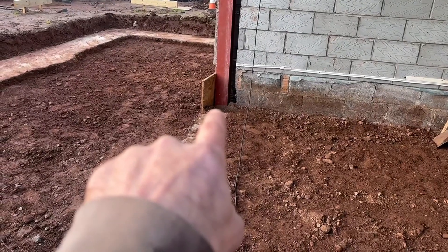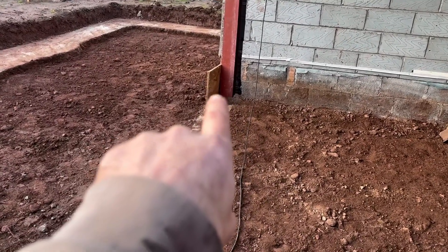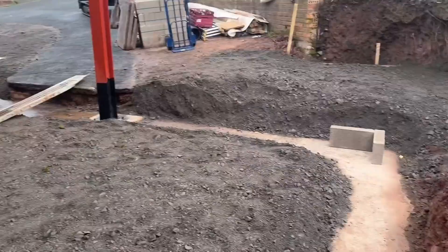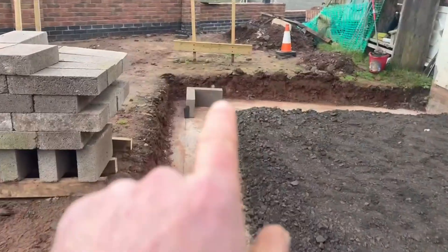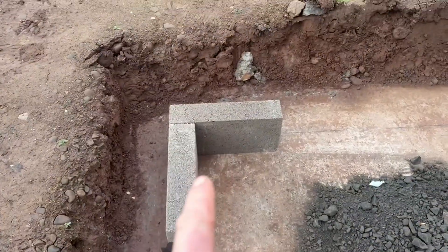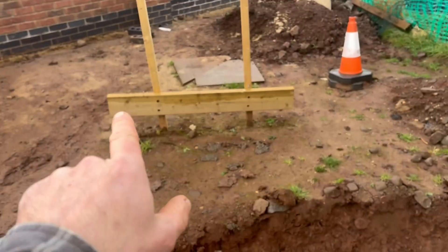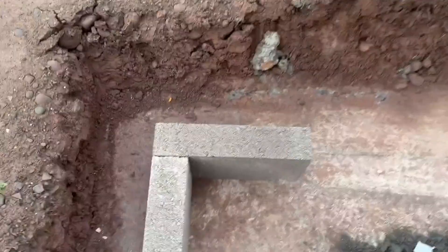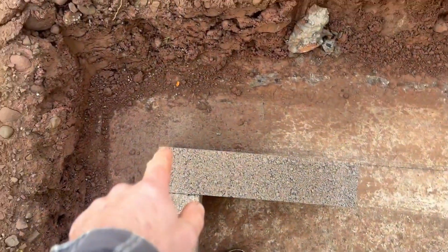While I'm waiting for the stone I just need to scoop the bits that have fallen into that hole, waterproof the bottom of my steel columns up to DPC height. All my stone's down and I've got my corners set up ready to go in their correct positions. I don't need to show you how I do that because I've already shown you - we set the profiles up which showed all our building lines. I marked this out last night when it was getting dark.